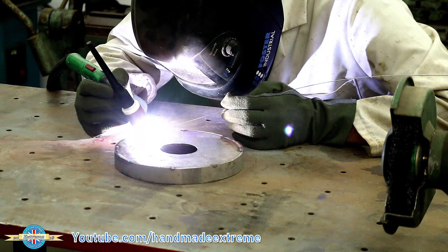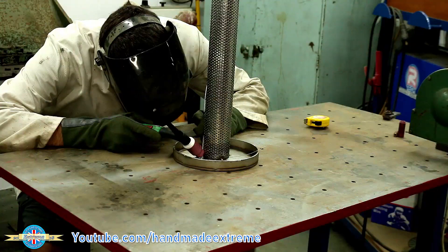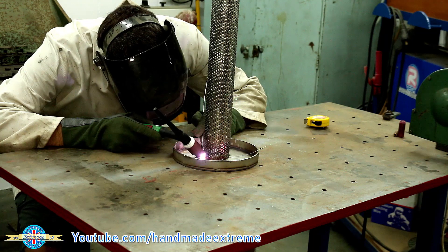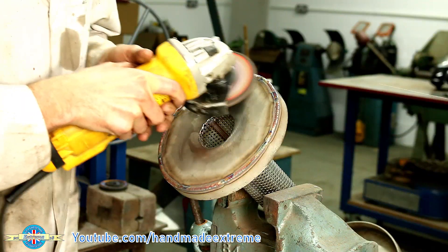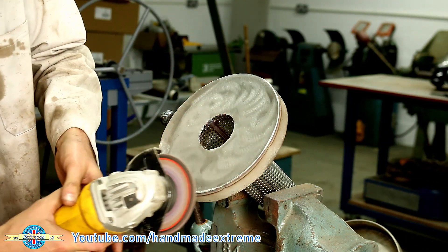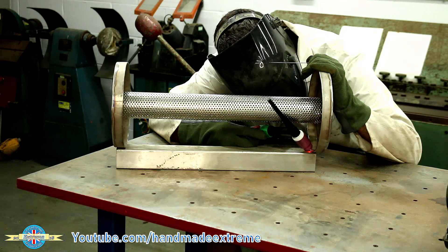Just using the foot pedal here to do the pulsing, with a little arc shot there. The inner perforated tube can be welded onto one end, flipped over and welded on the other end as well, and I can just clean off the weld to give it a nice polished finish. Then I tack the whole thing onto a piece of box section so that when I'm offering it up to the car it won't roll around — it just keeps it in place.